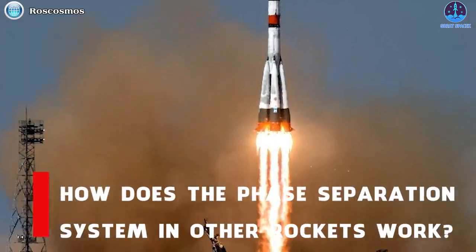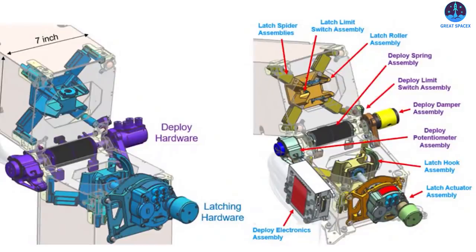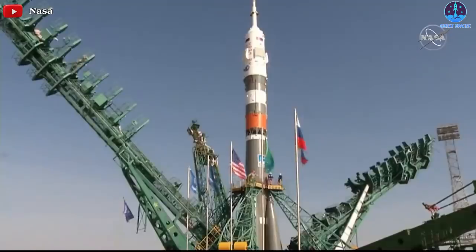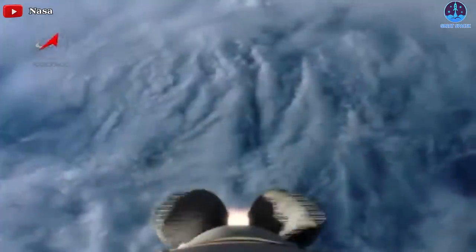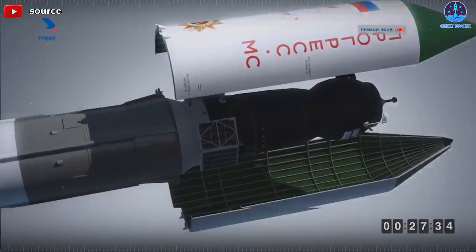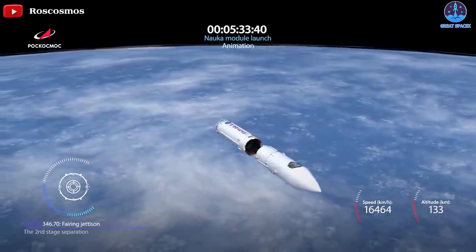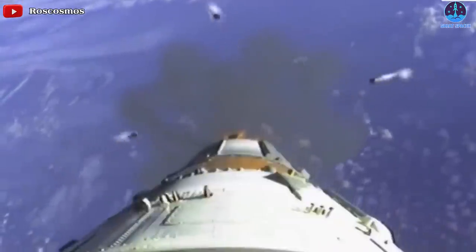So how does the stage separation system in other rockets work? In rocketry, there are generally two distinct types of launch vehicle separation strategies, all requiring some kind of actuating latch or frangible bolts to attach and detach stages. Some rockets, particularly Russian vehicles, rely on hot staging, in which a separating stage ignites its engines slightly before or at the same time as it's released, blasting the stage below it. More commonly, rocket upper stages are jettisoned a significant distance from lower stages before igniting and heading toward orbit, using either small solid rocket motors or small vernier thrusters. Each separation event introduces additional risk to the success of the launch mission, so reducing the number of separation events reduces complexity.